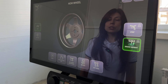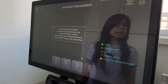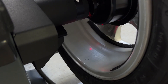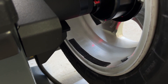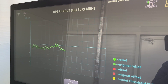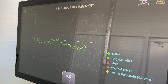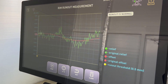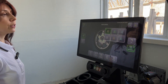The Stellar balancer has a rear splash guard for complete dirt protection. Rim Run-Out 2.0 accurately identifies rim deformation and evaluates the need for restoration and repair. The Laser Vision measurement system allows contactless measurement of rim run-out, eliminating the need for a roller gauge. If the wheel rim is damaged, the screen will display the message 'Correction Required.' If the radial run-out is insignificant, the machine will indicate 'Run-Out is OK.' Data is saved separately for each of up to six operators.